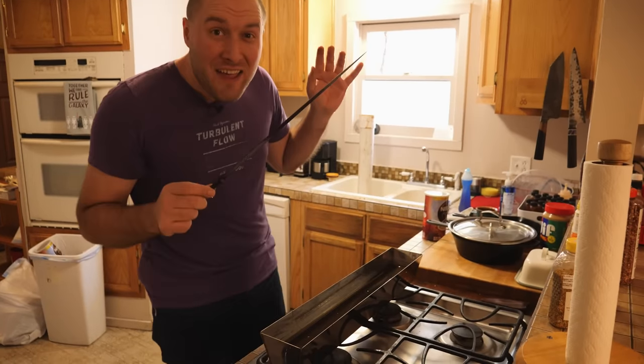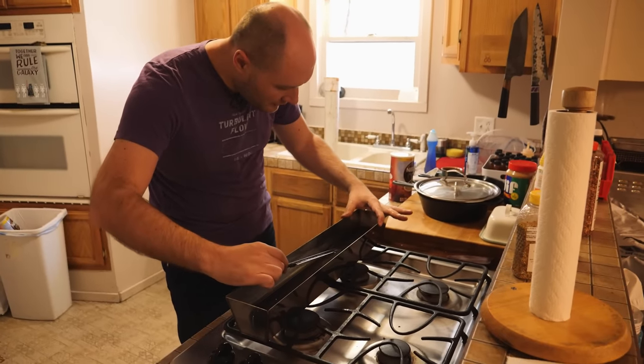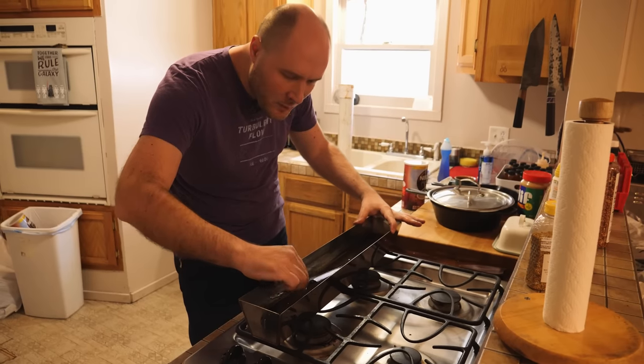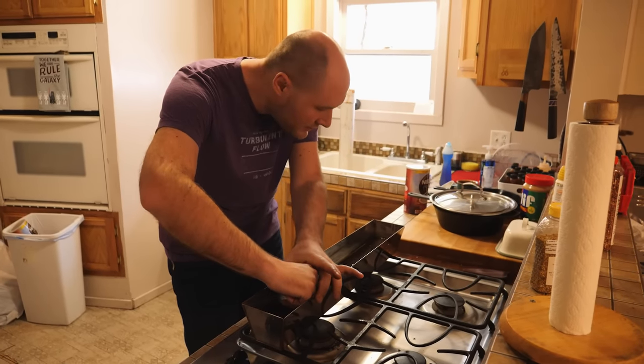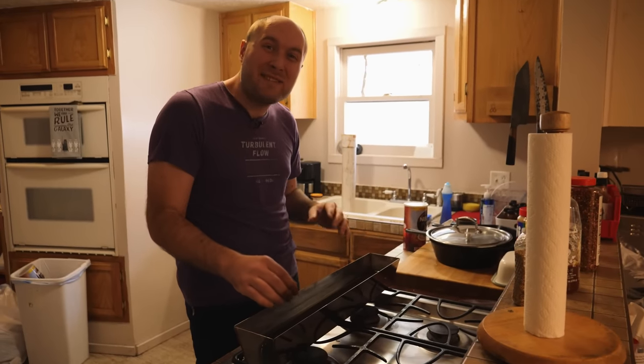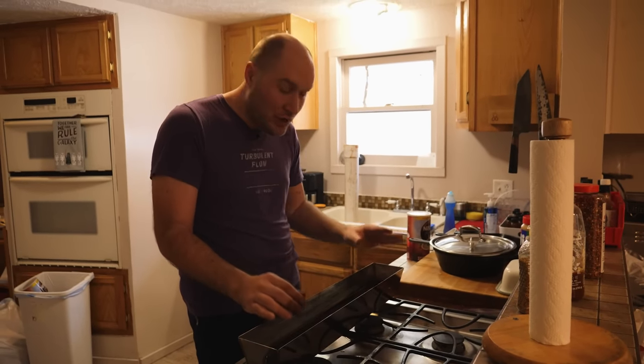The blade's been neutralized for five minutes. I just rinsed it off and I'm going to stick it right in the coffee. I've got some wires to suspend it on, so it won't be touching anything except for on the tang and the very tip of the blade. I'm going to let the blade stay in the coffee for about six or seven hours, then take the blade off, blow it dry, and let the coffee finish cure overnight.